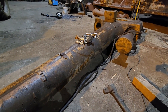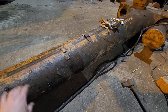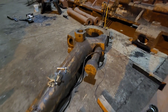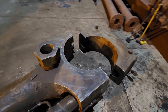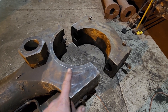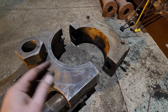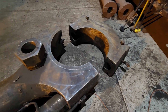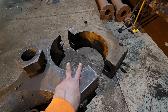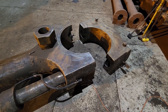I'm basically going to get in here and clean this thing up with the wire wheel — it should be a pretty nice surface finish underneath all the grease — and then take my measurements to figure out what I have to do for this liner. We're thinking of making a pattern and casting it out of iron right here on site, then machining it. We're looking at getting a lathe big enough to do this, putting the dovetails in, casting the babbitt lining, and doing the finished machining on the babbitt. Hoping we have the time and facilities to make these parts completely in-house.